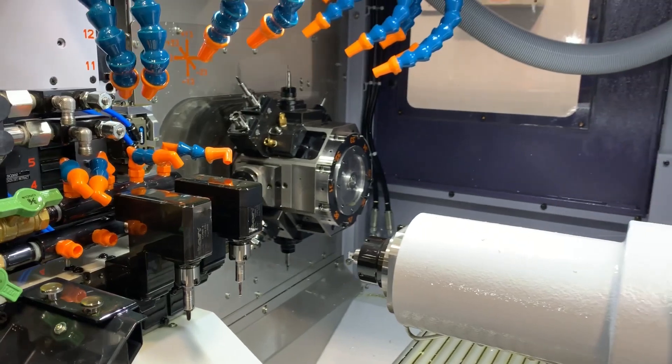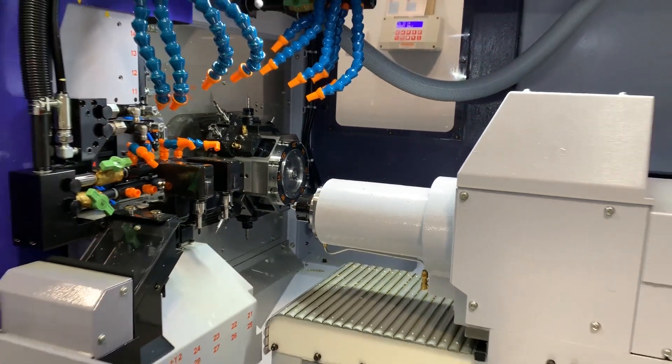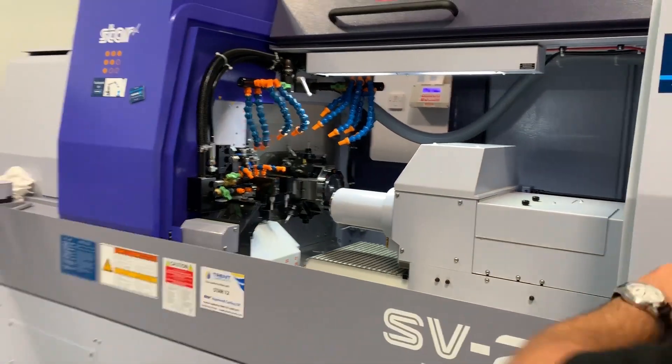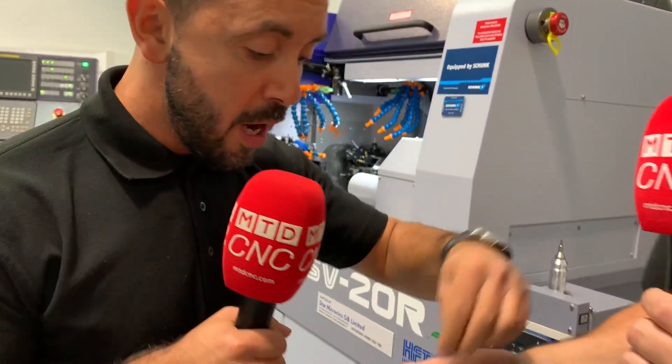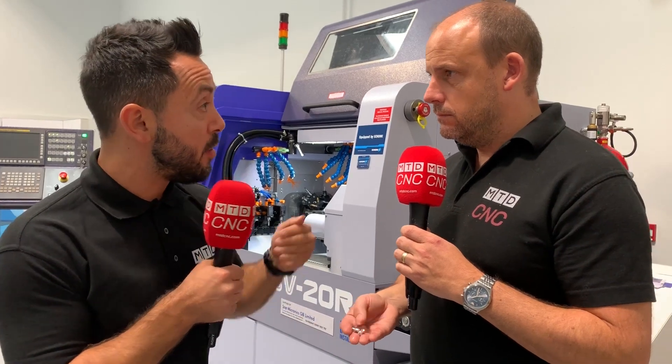This is all manual time where the machine is down. But not only that — the tolerances: from op one and op two, the features and the relationship between the features, or if you add six-up work, every time you move that component you could be reducing the tolerances from one op to another and potentially start looking at scrapping the parts.